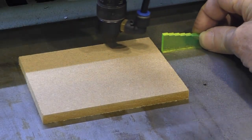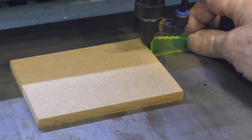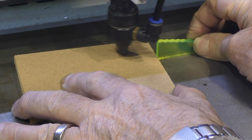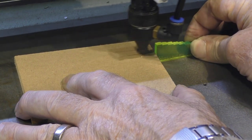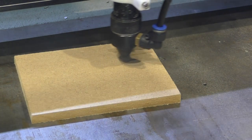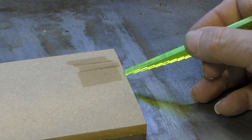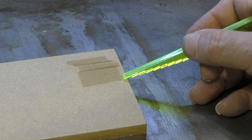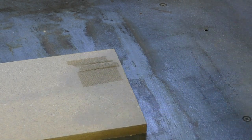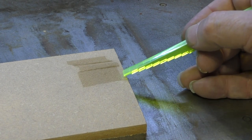So here we go. We're starting from here. And what I'm trying to do, I'm now going to push the job across until, look, it just touches my piece of material there. Just check. Yeah, it's just about touching. Now what that will tell me, when we look at the pattern, and we can do that now, that's the overrun time, the acceleration time. Because the acceleration time is not part of the cycle time. This is specified at 100 millimetres a second, and the machine runs it at 100 millimetres a second. Anything else beyond here is deceleration, turnaround, and acceleration time.